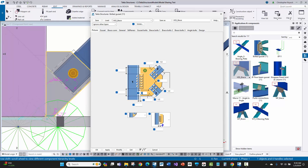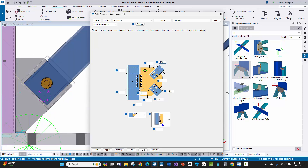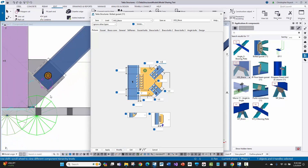The first setting is the 1-inch offset from the corner of the brace, which is pretty commonly shown on engineering drawings for this style. If you wanted to pull that back further, you can set it to 2 inches, and it adjusts the gusset plate geometry accordingly. A common thing people want to do right away is get the gusset to go straight down vertical to the base plate. I'll switch this option and press modify, and you'll see it goes straight down to the base plate and elongates the gusset — exactly what we want.